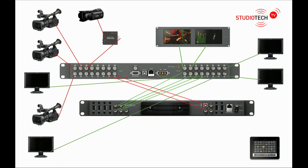You're not having to re-plug anything. When you've finished that you might want the eight inch monitors in front of the producer — one showing camera one and one showing camera two. The two monitors on the right hand side in front of the producer would probably show program out on one and multi-view on the other. On the left hand side two other monitors can be used as confidence monitors for the talent to see what is going on — typically showing program out, or the multi-view output so they can see which shot is queued in preview.